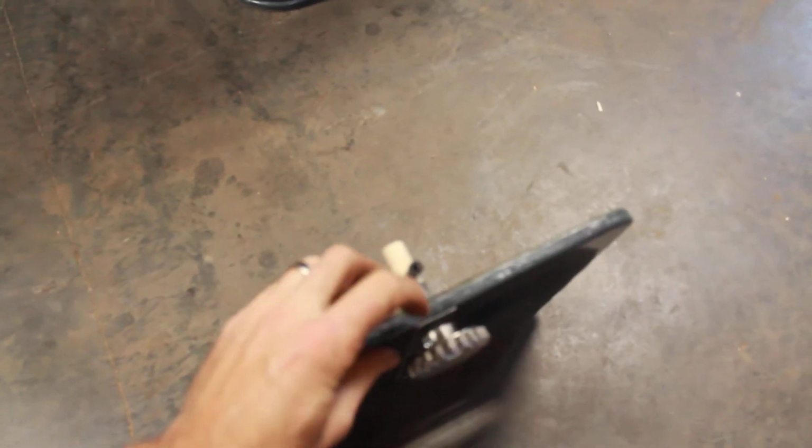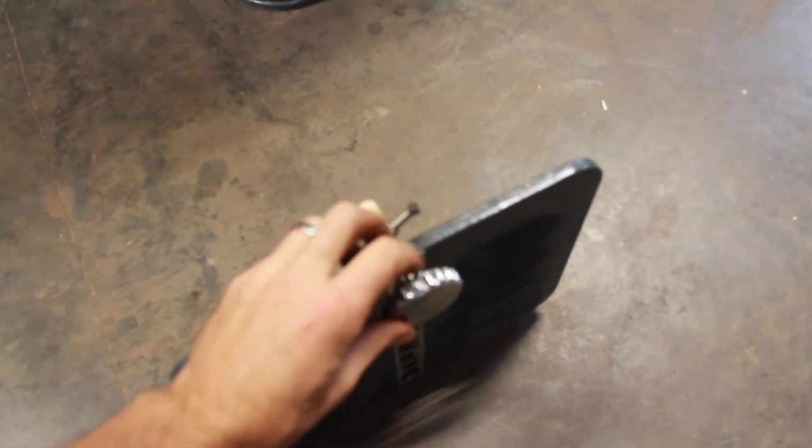So what I did is I just took a dowel that was a little bit bigger diameter than this shaft hole, and then got it down to the right size, and then put a screw into the dowel into this hole here, and then on the back side I just did a through hole here with a piece of leftover bolt from something and nuts on both sides so that it'll hold when it's in there.